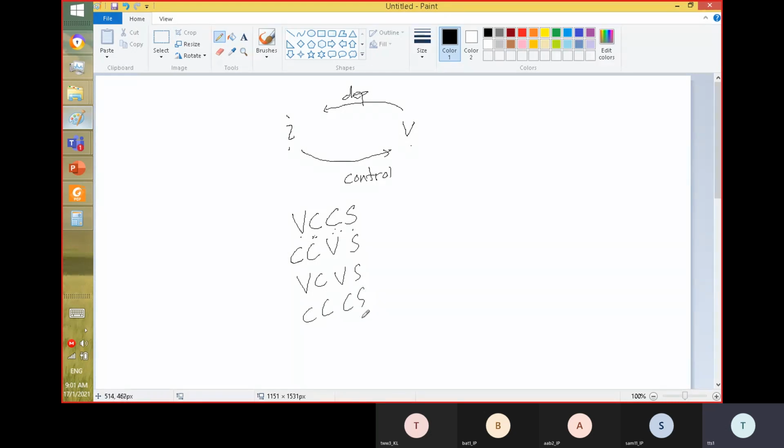If you find all the possibilities here, with all these components, which one depends on the other. Sometimes, for example, let's say you have one resistor here, and here you have one current source. Let me draw it better. This symbol tells you this one is a current source. How do I know it's the current? Because I look at the arrow. Usually in circuit analysis, when we use an arrow, it means the current.